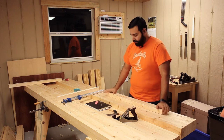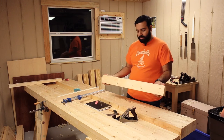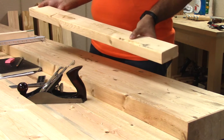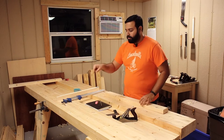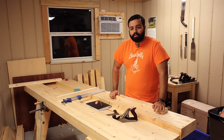So I've been planing this surface so long. These are the stretchers that I'd started to make and this wood is a little chewed out. So I think I'm going to make this one of my bearers and I have a cleaner piece of 2x4 over there that I'm going to turn into the actual tenons here.